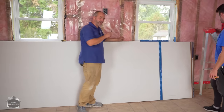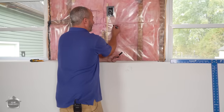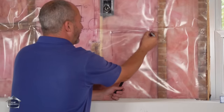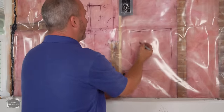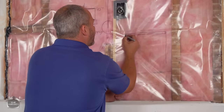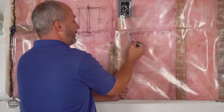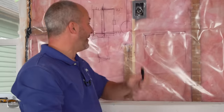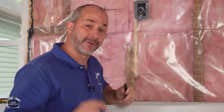Now, you want to do a little math, because the last thing you want to do is cut this drywall exactly the right dimension. So if this represents the whole dimension, the wall, ceiling, and the wall, you want your drywall to actually come a little bit short of the end. All the way across, well, that's almost a straight line, and then short on the other side. Remember, the drywall is 1/2 inch thick. So if you're 1/4 inch shy over here and 1/4 inch shy over here, that makes it a lot easier to install. And the next sheet that goes up is going to come out past that point. All right, and it's going to go in horizontal, but you're going to have a nice solid joint there, so you don't have to worry about being perfect. Drywall is not finished carpentry, it's drywall. So you really want to take advantage of the opportunities you have to cut these short spaces so that the install goes nice and simple.